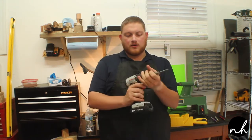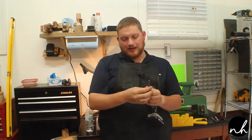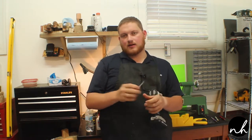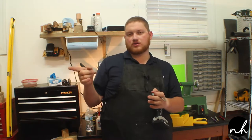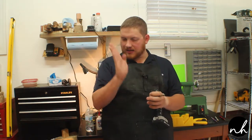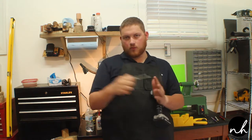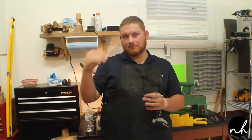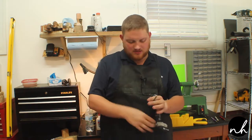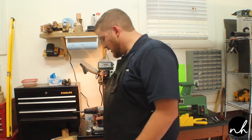The end part here, the little bit fatter piece that you see on the end of the barrel trimmer, is called an end mill. These are blades that go on the end of your pen blank and square up the end. So for some reason, when you cut your blank, if it's at a slight angle, that's okay. That's what this end mill is for. It squares up the end and also trims down the excess of your blank to be flush with the brass tubes. So you will need a barrel trimmer and an end mill.